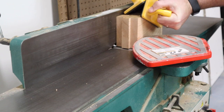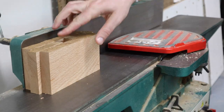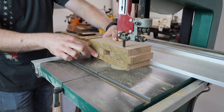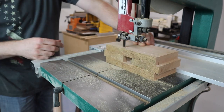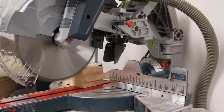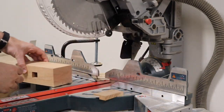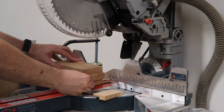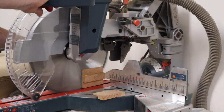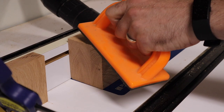With the head of the mallet dry, I'm going to square it up on the jointer, and then take it over to the bandsaw and clean up the top. And back to the miter saw, we trim the ends of the mallet head — we're going to cut these at a two and a half degree angle. At the router table, we'll use our chamfer bit to break all the edges.